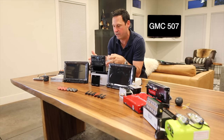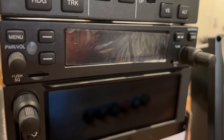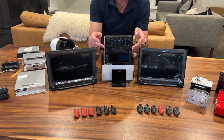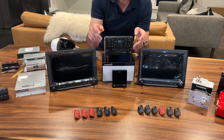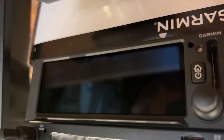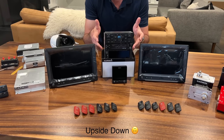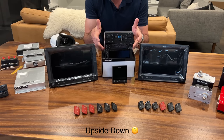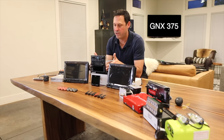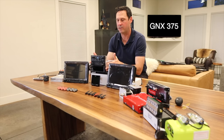Here's my number one radio — the GTR200B. It's got Bluetooth capabilities and you can control your radios through the G3X touch, but I like being able to just reach up and control it directly. Beneath that is the GNX375, which is the meat and potatoes of the IFR package. It's a WAAS-enabled GPS and it also has a transponder with both ADS-B in and out. It's touch screen as well. In my Bonanza I have a GTN650 which looks similar, but the big difference is this doesn't have COM or NAV radios — and of course it has the transponder integrated.